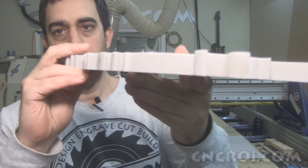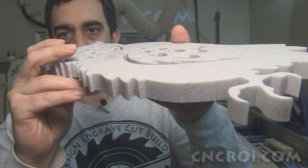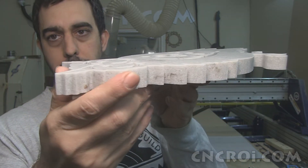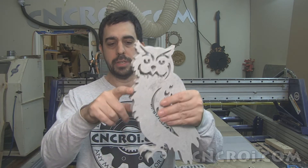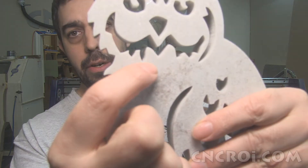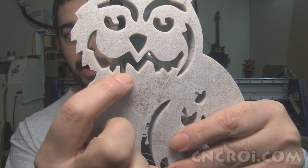Just looking at the profile, you can see how incredibly clean the results are. Now if you're wondering what an alternative to using slate and waterjet would be, the closest one I could think of is actually Corian. We have a milling machine — we can even use the machine behind me here — and we can do this out of Corian, or we can also do the Corian in the waterjet. So again, it just depends on the application and the specificity of the design. Very sharp things like this are really tough to do with a round bit, but with the waterjet, it's really easy. The disadvantage to a waterjet is that it's relatively slow compared to a mill.